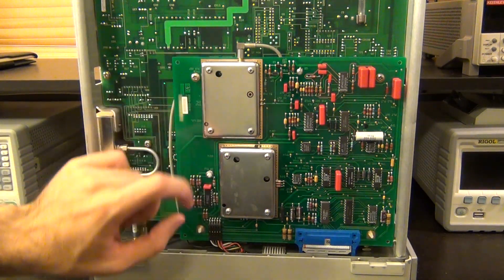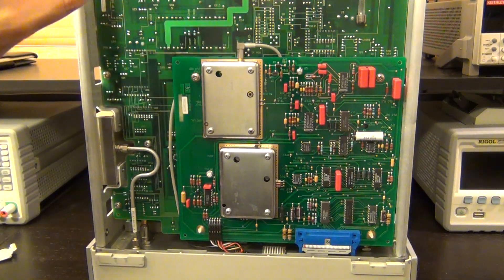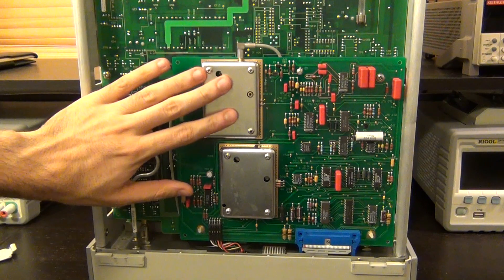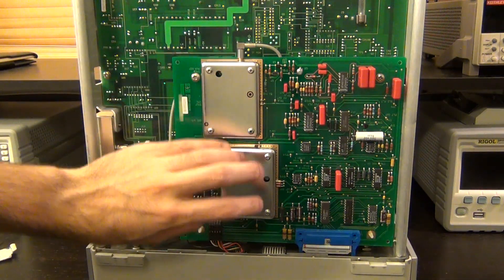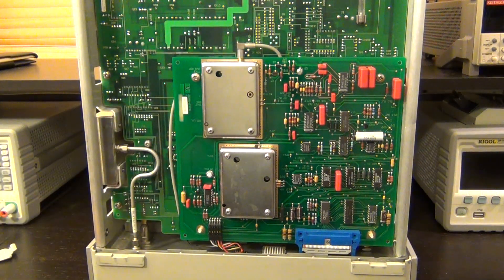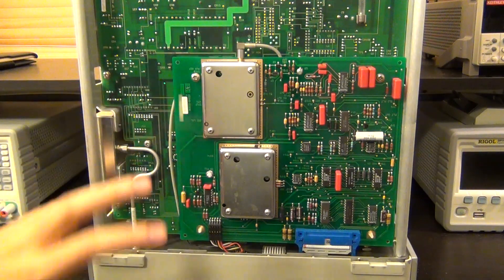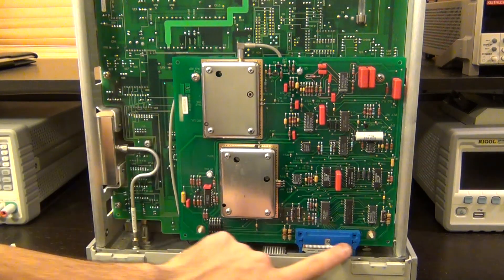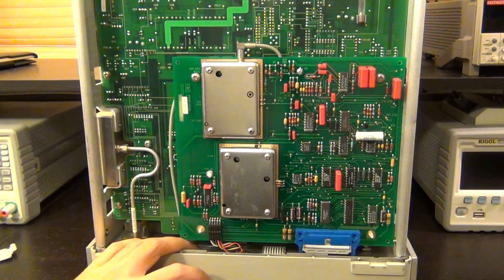There's a separate board sitting behind this one. Right off the bat you can see it has a connector to the front — that's where the power sensor is connected. It has a bunch of cans to protect something underneath. This is the power sensor's reference output. Again, it's very critical that this is exactly 50 MHz and one milliwatt of power. They've made sure this 50 MHz doesn't leak anywhere else, because one milliwatt is still a reasonably large amount of power — they don't want to radiate this inside the case. The 50 MHz output itself is coming from some synthesized source internally from a 10 MHz reference.